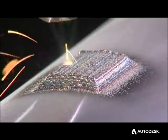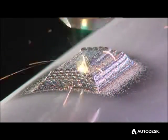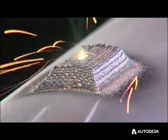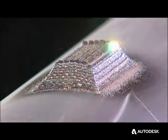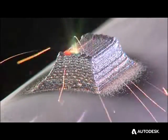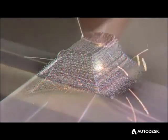The alternatives to DMD are considerably less attractive. Machined lugs could be TIG welded onto the shaft, a costly option in both time and labour. Or the component could be machined from solid. However, this option would require a much larger forging and CNC post-machining capability.